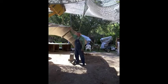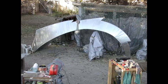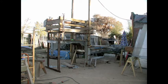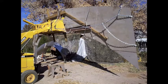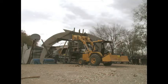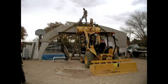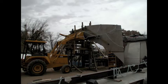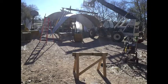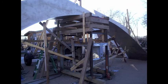And this really takes on some enormous problems. The metal we had was 8 by 30 feet, 3/16 of an inch thick, weighing in around 2,000 pounds a panel. Each side was made out of 3 pieces in order to make one sheet. As you're coming to some of the framework here that shows how we were putting the piece together, and here's a piece where I'm in the picture, so you get an idea of the huge scale and the size of equipment. But anyway, as we worked along and construction kept moving, we managed to come up with systems and styles using the paper model for construction.